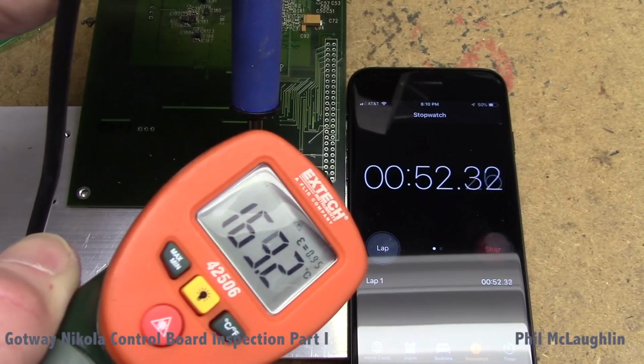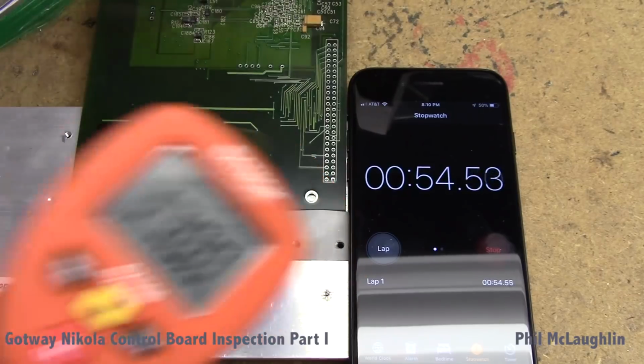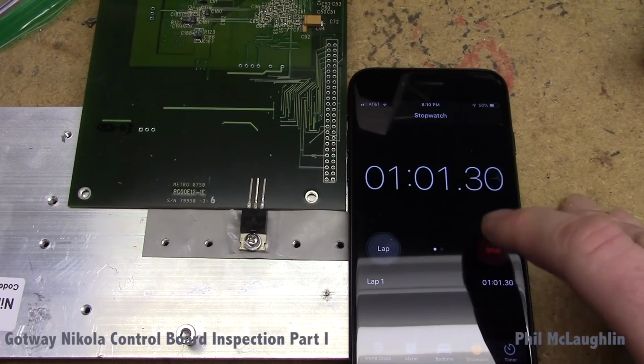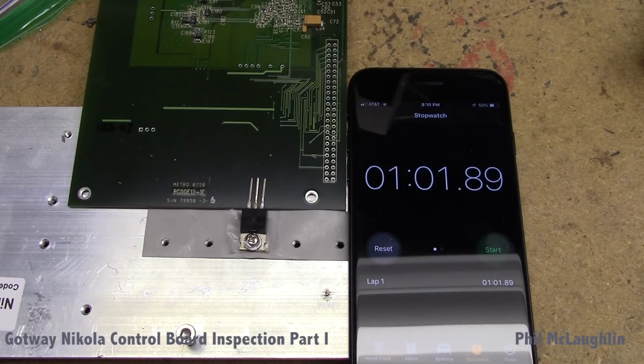Yes, I'm going to stop this right here, because by the time we get to a minute, we are talking about a lot of temperature in there. So this gives me the basic feeling that we probably should not be using Scotch tape as a thermal coupling. It also makes us suspect that relatively small levels of contamination between the MOSFET tab and the thermal pad could make a very significant difference. I'm actually surprised at how much difference that makes.